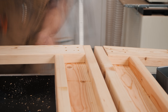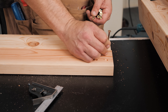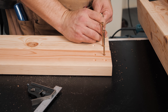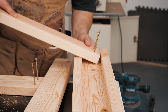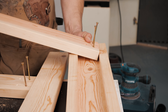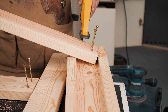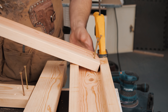Now we're going to put on our angled legs, and this is very important. My hole patterns are different here - I took the time to measure them out so that they wouldn't run into each other. What you're going to do is put in the top screws first, and that's going to angle the leg the right way. Then put on the bottom. When you put in your leg, angle it so it's just touching both edges - it's going to get sucked down when you screw it in, but you can use a clamp to help hold it, making sure everything is flush and square.